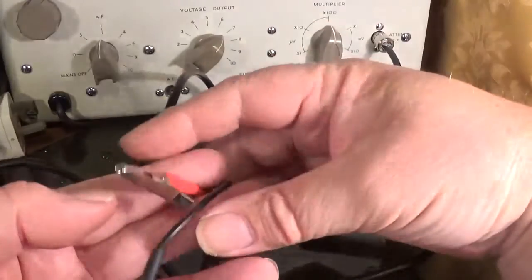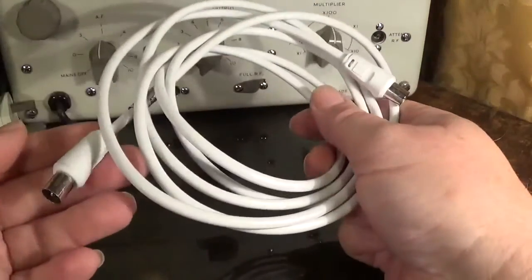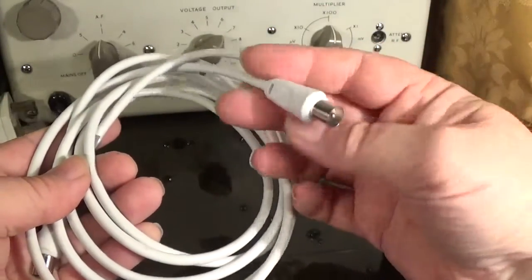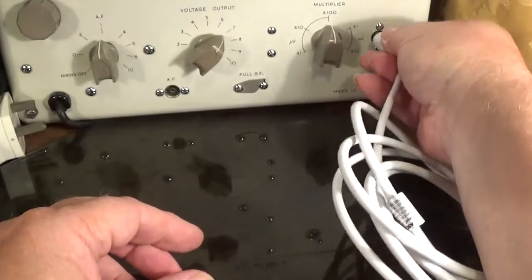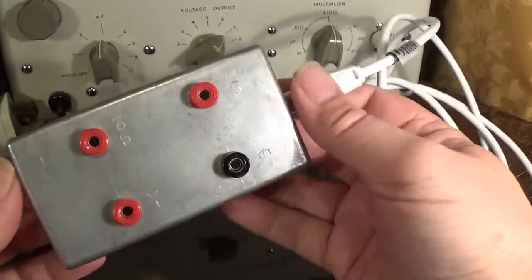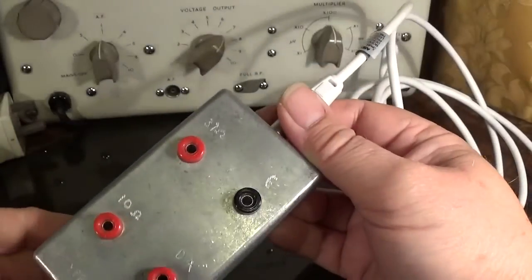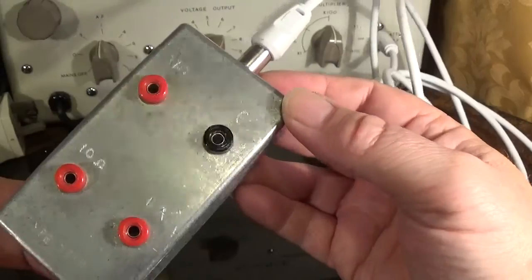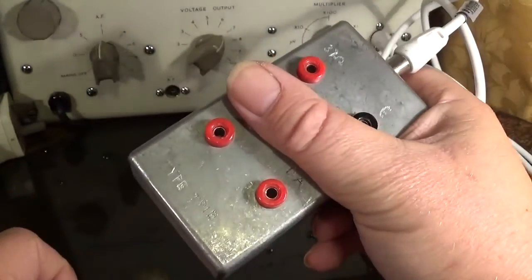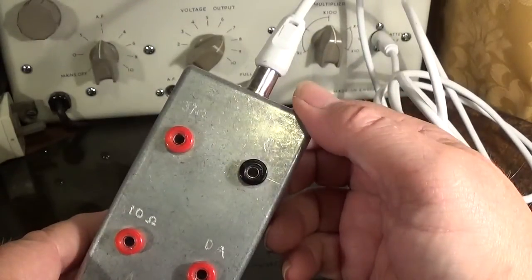If you don't use a DC blocking capacitor, there's a chance that you might blow the attenuation resistors inside — they don't like it. You can make up one of those leads by going down to somewhere like Poundland and getting a TV lead, cutting one end off — works perfectly fine. And in fact I also use this here, which is a dummy aerial built to the design of the original that came with this unit — the Advance TP1B. It's a pretty simple circuit, available on the UK Vintage Radio Forum. These outputs are then connected to your radio using banana plugs, and there's a capacitor inside already that will block any DC.